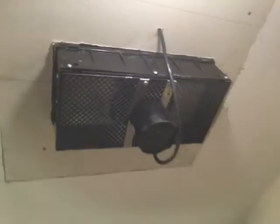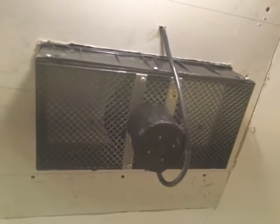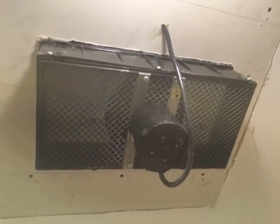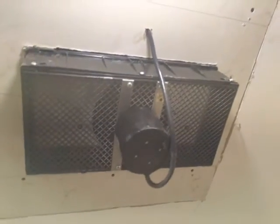So what I did was go to Lowe's and purchase a ventilation fan they use for crawl spaces and places like that. This is a crawl space type fan and it moves about 186 cubic feet per minute. I just kind of wired it in, and as you can see I still have some drywall work and painting to do.